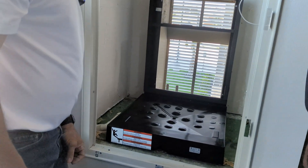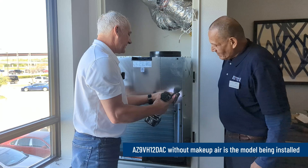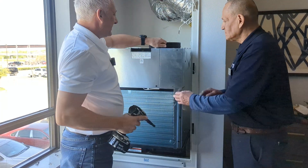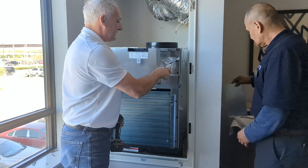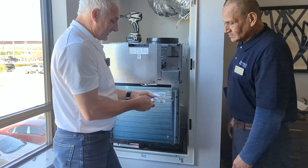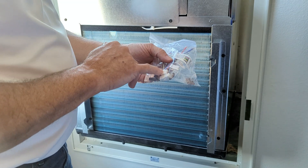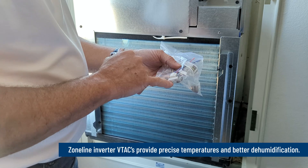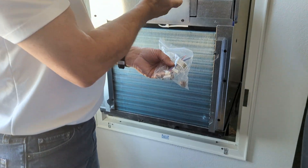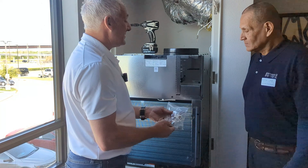For electrical preparation, we've got a quick disconnect for our electrical. We're going to go ahead and remove this panel before we push the unit all the way back in and then reinstall the panel later. In the junction box we have two thermostat connectors. Since this unit is an inverter, it can either use a two-way communicating thermostat — which has a five-pin, five-wire connector — or you can use a stage thermostat as long as it has a Y2 signal to indicate to the unit that it needs to increase or decrease capacity.